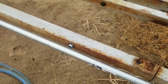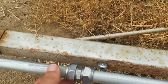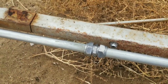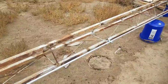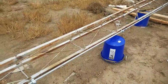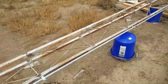We started pulling the tape back, and we had a ton of it, so we're actually past the connector. We think we're getting stuck here on this connector somewhere. This is kind of tricky. It's a good thing we're not just trying to push the wire through — this would be hell. Great news: I wiggled it past whatever the hang-up was, so we can get another 10 feet before it gets stuck on something else. Fish tape is awesome because you do it pretty much once.